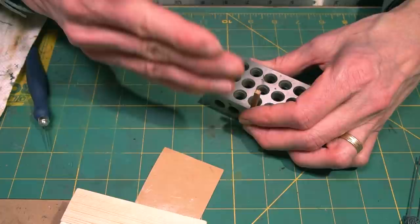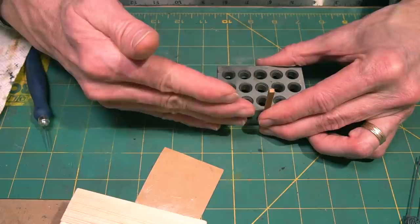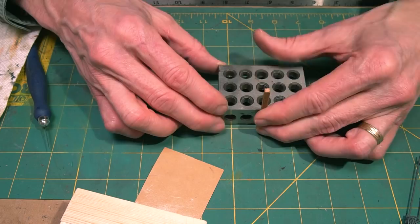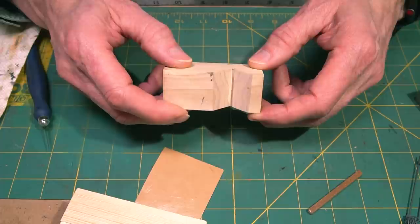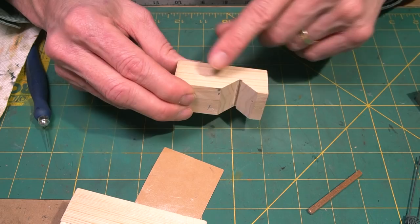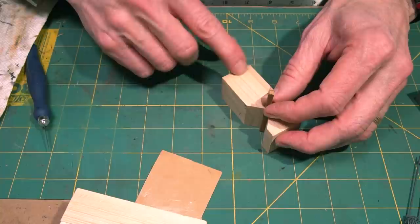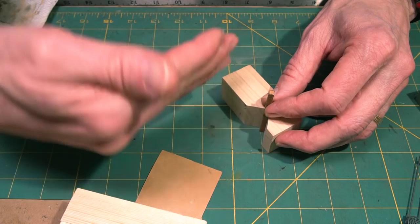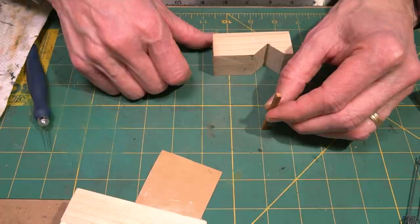What if you're doing a post and you want it to be 90 degrees to the base so it's perfectly straight out, but you also can't have it tilted the other way? So it might be 90 degrees in one dimension but not the other. Woodworking is another hobby, so I took a block of wood, set my table saw at 45 degrees, and ran this piece of wood through that way and then obviously the opposite way. Now when I put this on the table I can put my post in there and hold it while the glue sets, ensuring it is 90 degrees in both dimensions. Very simple, easy, and keeps you from ending up with a post that isn't straight.